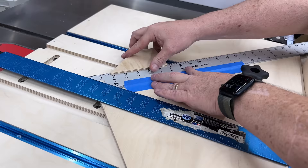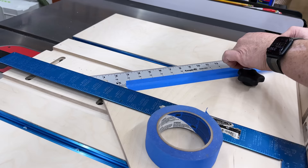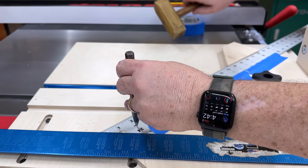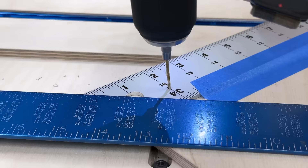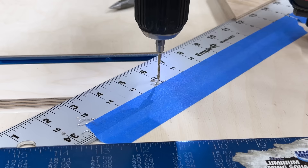We'll tape it down and check it. We're taping it because we need it fixed in place so that we can screw it in place. If you order the sled from us, the picture frame triangle and the ruler will not be attached for shipping — I'll mate them, mount them perfectly, but I'll have to detach them for shipping as I can't get a box big enough to ship them pre-attached. Not to worry — they will come back together perfectly. We've tested it, no problems. We're going to take this one off to trim the ruler down a little bit and put it back on. Then I'm going to measure every two to four inches down the ruler to get four or five screws in it. I'll start by drilling a hole in the ruler at about the diameter of the outside of the screw — a number six by three-eighths-inch long screw.